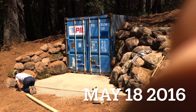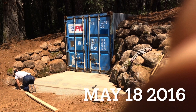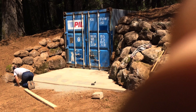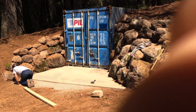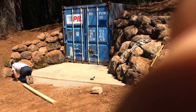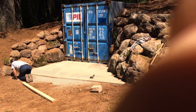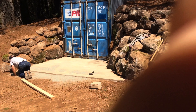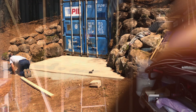A couple things to think about. I did tilt this forward just a tiny bit. There are holes in the front, so if there's any runoff, we left a gap under there that it could come out — and I have seen it come through with really heavy rains. Number two: I took some tar and tarred the whole top and side of it. Then we bought a big enough tarp to go over the whole thing, folded it in half, and tarped it.